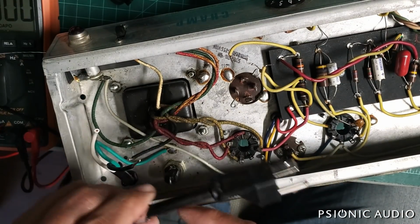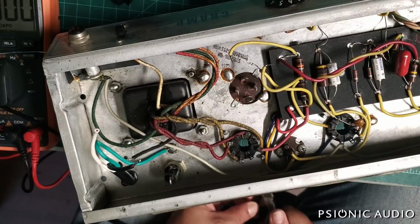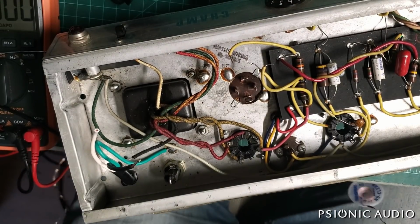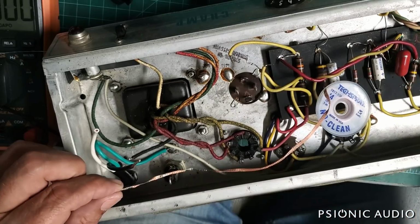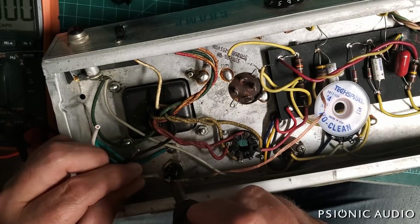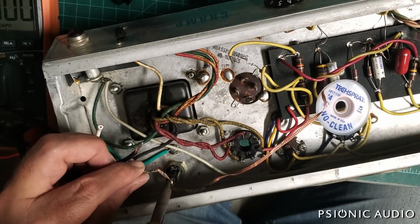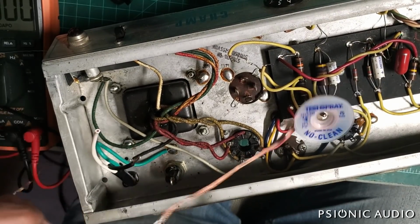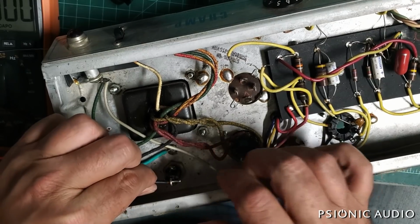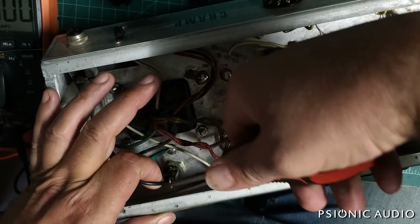This is not the Fender original. That's why this is good wire to work with. The original ones have a red plug on them. And the ones with the red plug, the coating of the cable itself is this really soft rubber that does not react well to ozone and stuff over the decades. And it begins to degrade, and it also pulls out from whatever clamping force the red plugs used to exert on it. So you often have a spot at the very end where there's nothing clamping the cable. You can see the wires beneath, which means that there's a lot of stress on those wires, and someone could touch them accidentally while plugging or unplugging the amp. And if there's a nick in them, all of a sudden you get electrocuted.